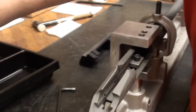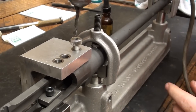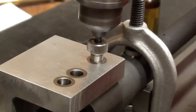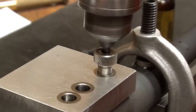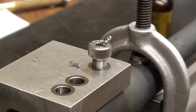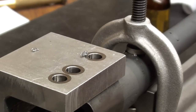Make sure your overarm is down tight. Grab your drill bushing — number 21. On this particular one we're right over the top of the chamber so we do have to be careful about depth. I've got the drill set into the chuck so when it stops it keeps it from drilling too deep. You can always pull that bushing out and have a peek, or use a caliper. You can use a toothpick with marks on it to measure your depth to the center point of the drill — lots of different ways to do it. If you've got a depth micrometer with a pin point on it that's awesome, but not everybody's going to invest in that kind of tooling.